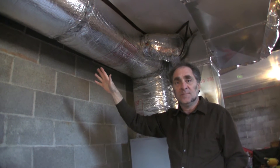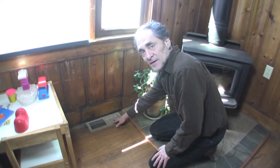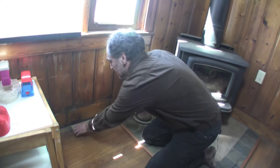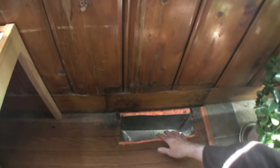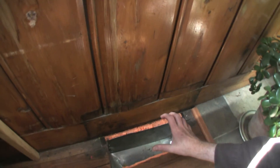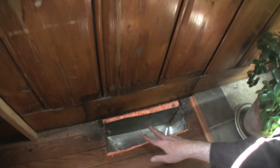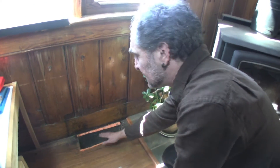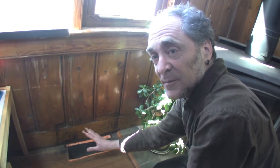This is a supply register — this is where the hot air comes out in a ducted system. In this case the ducts are down in the basement. It's very important to make sure the supplies are well sealed. Taking this off now — this piece here is called the boot. The boot is attached to all the ductwork and brings the air right into the room. You can see how much foam was put in here because the HVAC contractor who installed this just cut a huge hole — that's very typical. HVAC contractors don't tend to care much about air sealing, so have a look around your registers and see if there are any gaps.